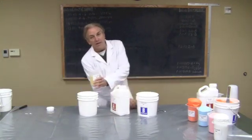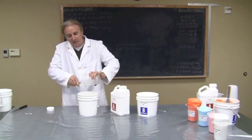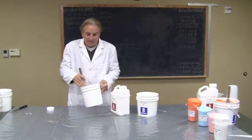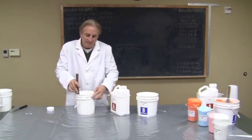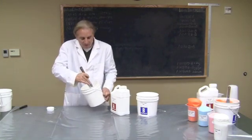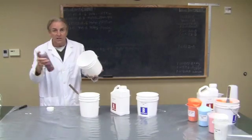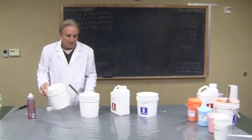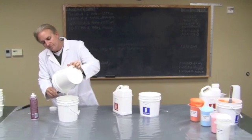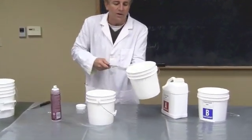We've pre-measured out our component A. Component B is already in the bucket, and so we're going to pour that in there and scrape the component A into our mixing bucket. Now, time starts whenever A and B touch, so there's no time to stand around. We want to go ahead and mix that. Go around the outside with the flat spatula and mix it. I can look in the pail and see swirls of unmixed material, and it doesn't take very long to get them together. We have a clean bucket that we're going to use for a demonstration mold — use a little silicone spray, don't flood it, just a little bit — and pour this into the mold.